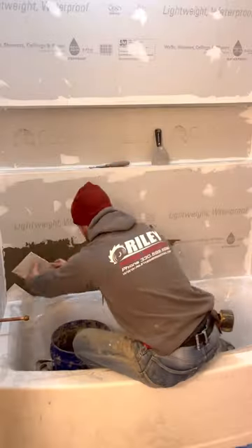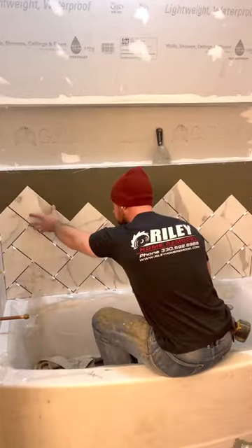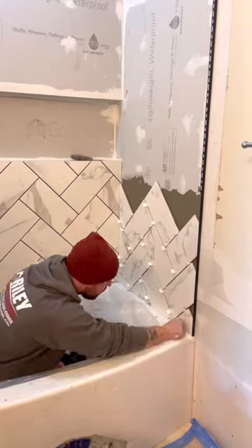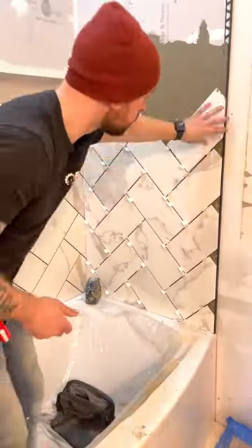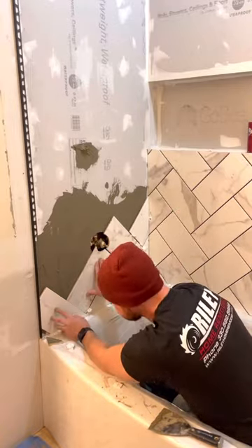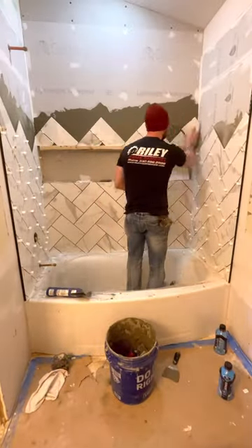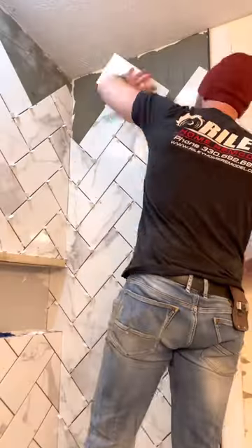In the last two videos we did a template of the back wall and also a template of the side wall. In this video I'm installing the herringbone on the back wall and running it up the side walls. I only installed the herringbone up to the bottom of the niche, then ran the side walls to the top of the niche. This allows me to tie in the tile above the niche on the back wall with the side walls, which was really critical so everything falls into alignment — the grout lines on the inside corners are matching and the continuation in the corners looks correct.